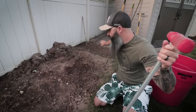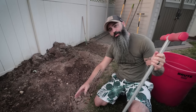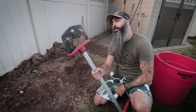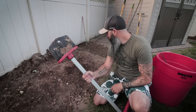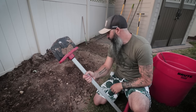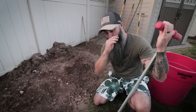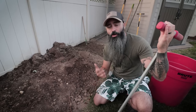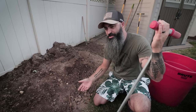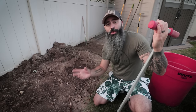To start this off, we're going to measure out four feet from the fence line here and we're going to put a line in the dirt. We're using one of these tools — I have no idea what it's called, but it basically cuts a nice straight line into your dirt. And then we're going to dig a trench about five inches deep. I don't need to go as deep as I did on the patio because there's not going to be traffic on this edging, so you can save yourself a little effort. We're basically building a really long, thin paver patio.